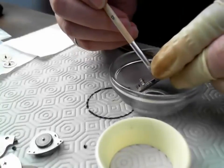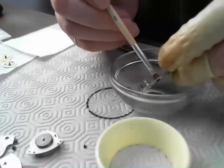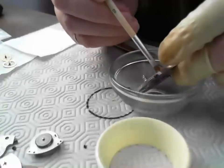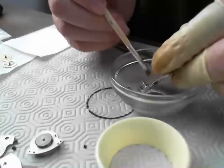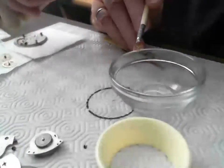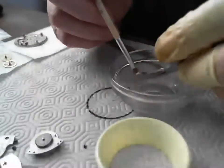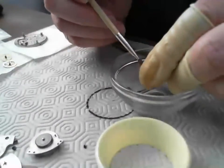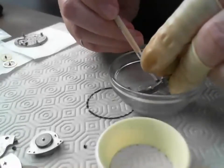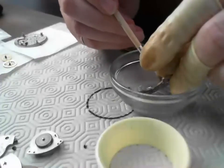I'm doing a pretty thorough job cleaning these gears. I'm also cleaning where the mainspring is, because it requires you to have these out. After I clean this, I'll show you what I do, but I basically peg out the holes. Hey pig, that's my Al Bundy impersonation. So I basically peg out the holes so I don't have an issue with leftover grime.